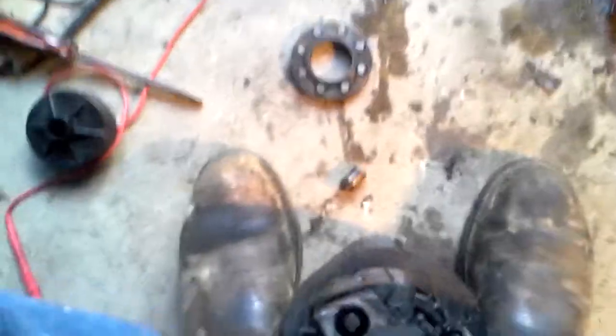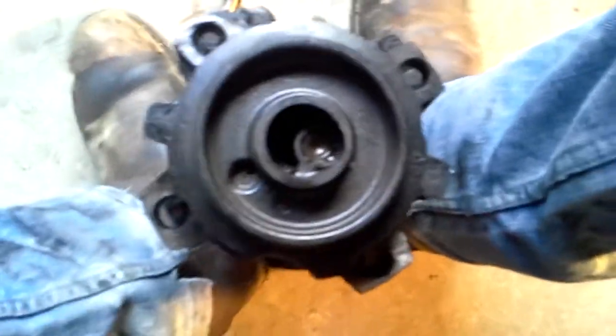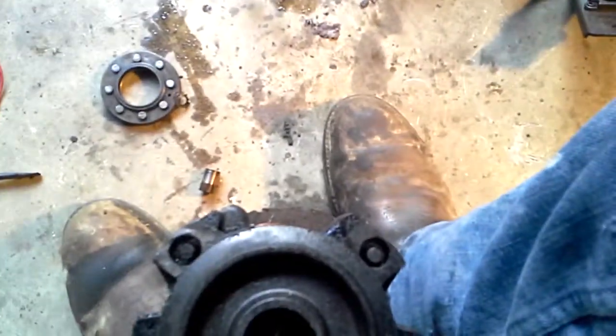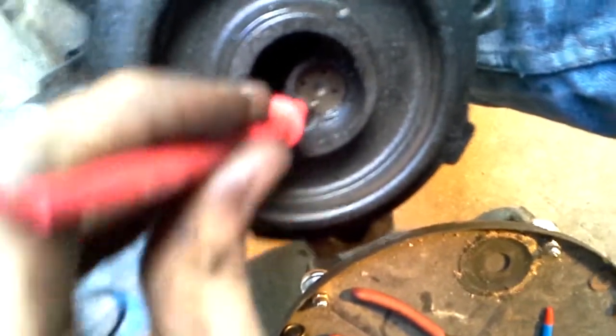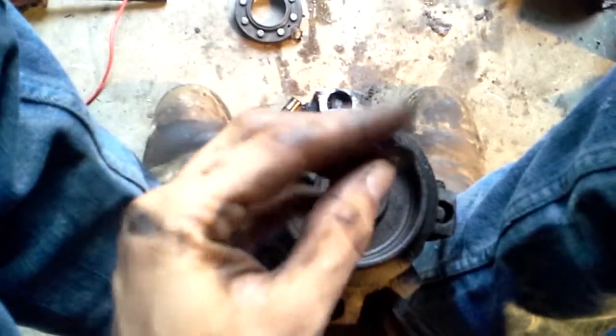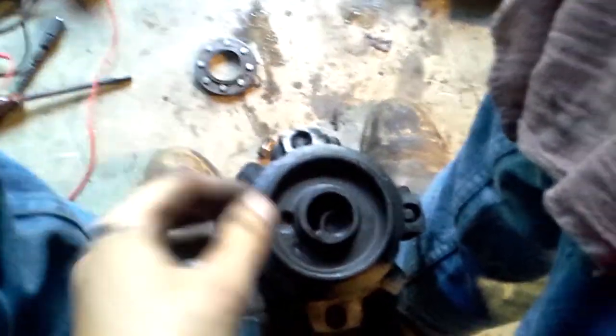It normally sits almost flush inside the stationary scroll until it makes compression. There's a really good video on this operating on YouTube. Down on the inside here is another relief — you can see the keeper. Pull the keeper out, and then the actual valve itself — it has a dome to it and a little nipple. When pressure builds it opens almost like a thermal disc and releases through those little holes.